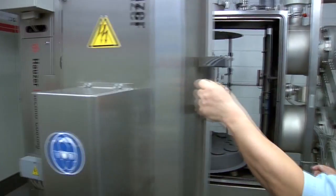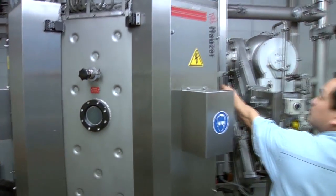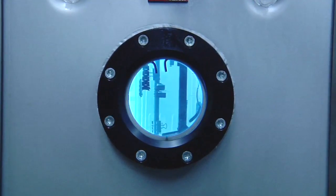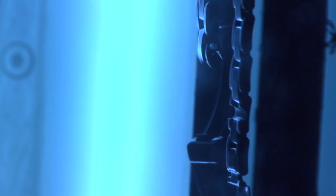Once that vacuum is achieved, a metal source called a target is ionized into an argon gas, which is called a plasma. The product is negatively charged, and those particles flying off of that target at a very high rate of speed are embedded into the substrate — the actual product.